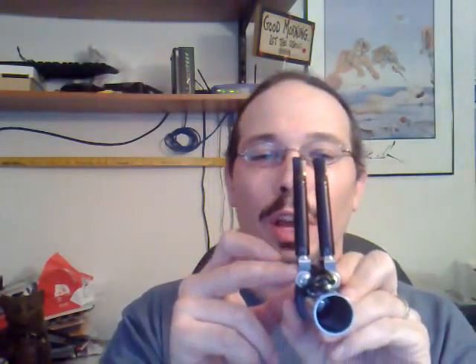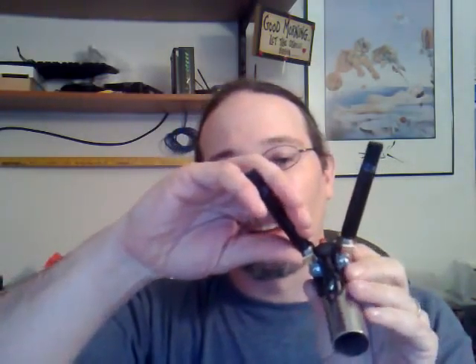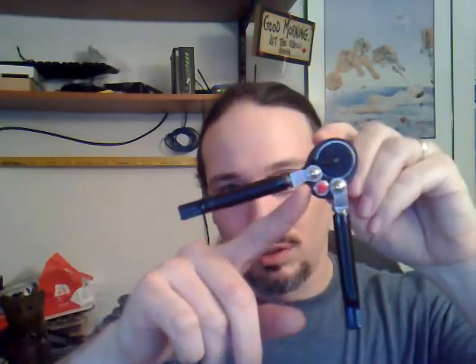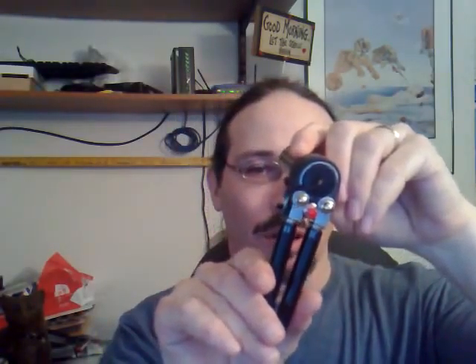You can see that the wires kind of come through into the atomizer connections on the bottom there, and it does look a little bit precarious — like those wires could easily get cut by the atomizer connectors, which are made of a thin metal. But on the top side, if you take a look at it, you'll see it's cut out a little bit, because both of these atomizer connectors will fold in and they bottom out against the button. The metal ring around the button is where they hit, and they stop going once they hit that. That prevents them from going into the wires too much so that they can't cut the wires.